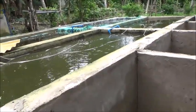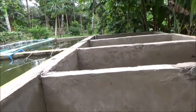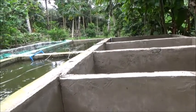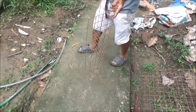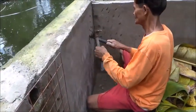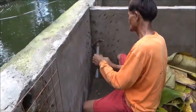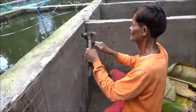So we'll be working on that today as well. But for now, I'm just going to get these potential leaks sealed up well. What Tata is doing here is making a little metal frame, a little metal box, and he's going to set that in the corners as a bit of strengthening. He's just chipping that out so that the new rendering will have something to grab onto.